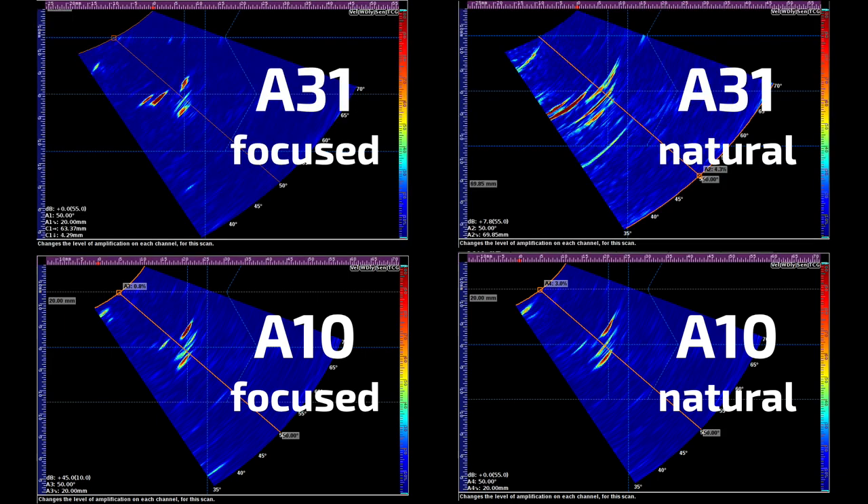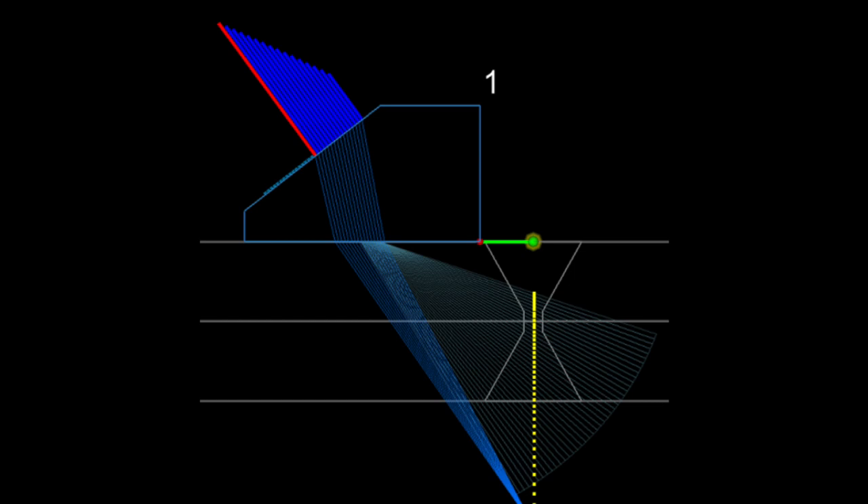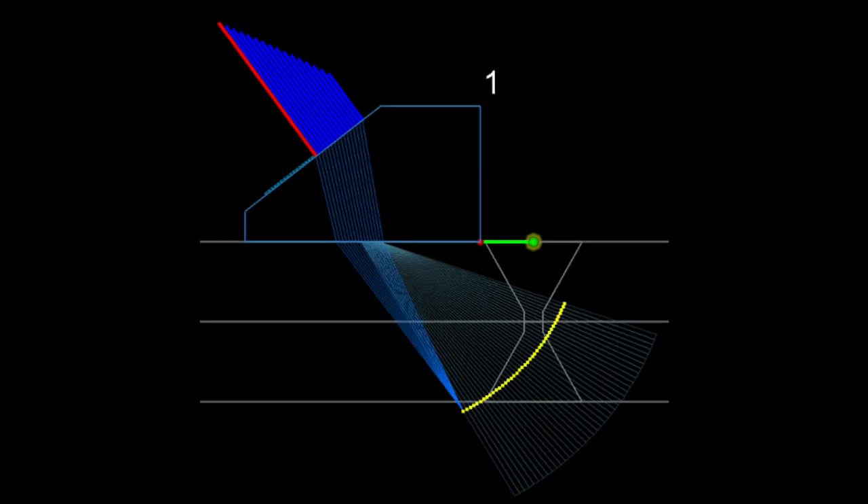In this case we have a much smaller aperture — it's half the size — so the near zone is going to be less than half the length. We can get away with running an unfocused beam on the smaller probe. Depending on which instrument you use, you have a few choices for your focal plane. On a Sonatest Veo, you can run at a true depth or constant depth, at a projected plane focusing at a vertical line in front of the wedge, along the sound path as a crescent along the S-scan, or run natural. A lot of people run at a constant depth at one and a half T, and most of the time I think this works really well. I'd recommend experimenting with this a little bit, and of course always do what is written in your procedure. I hope you found this video useful — thanks for watching.